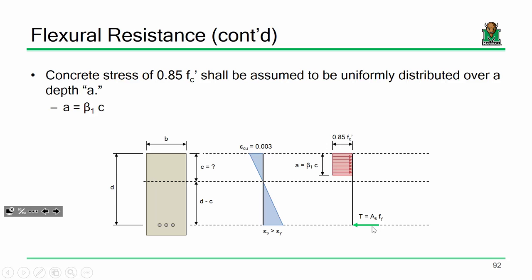Really, it's a trade-off, you know what I mean? As strength goes up, ductility tends to go down, and it's just one of those things you really can't avoid in concrete. If someone were able to develop a high-strength concrete that also exhibited that level of ductility and at the right price, they'd have their own private jet in a very short amount of time, because that would mean a lot of money for them.